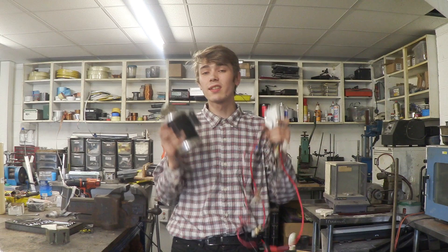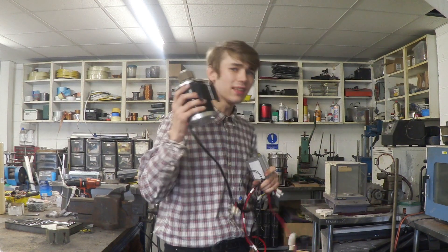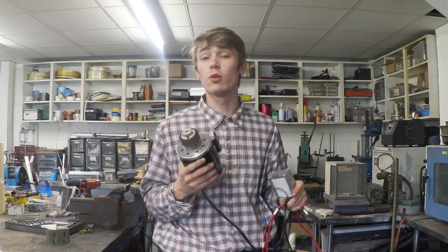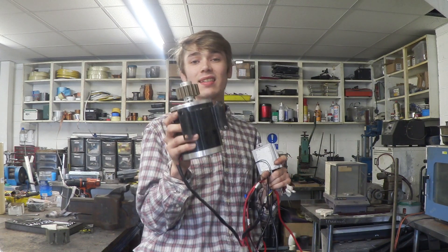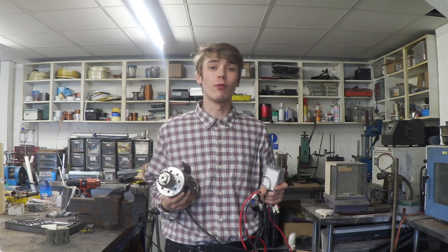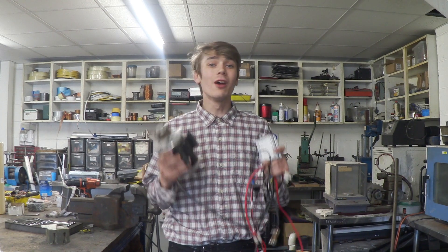The first thing we've got to do — we're still going to be using the same 500-watt motor setup we've been using in other projects, but there's a little twist: this drive belt cog has 16 teeth. Rob did a video on this technique, number 1084. The big cog on the back wheel has 136 teeth, giving us around an 8-to-1 gear ratio, which should provide a nice amount of torque.